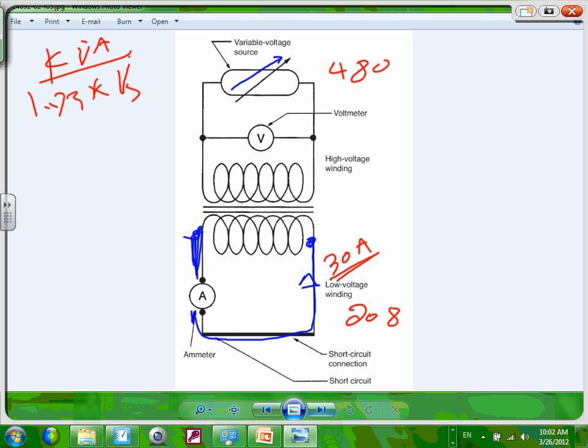They take a piece of wire and connect phase A to phase B, for example, or phase A to the neutral in this case. They put a voltmeter here, a voltage source right here, and they start measuring, adjusting until they get 30 amps. Suppose this read, to make it easy, 100 volts. At 100 volts I received the 30 amps, so you stop.